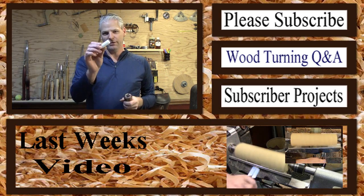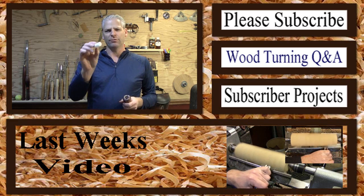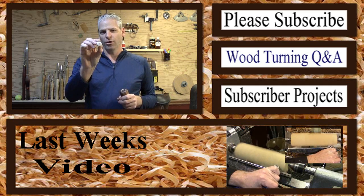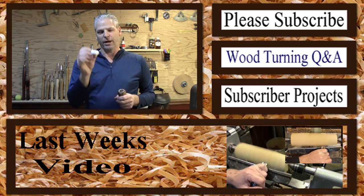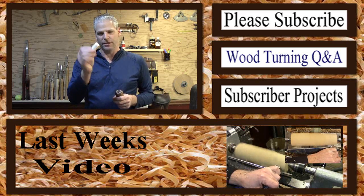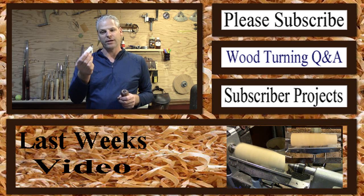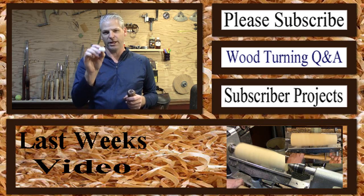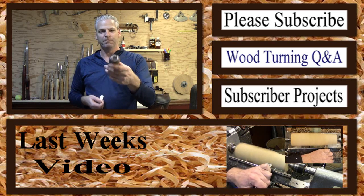Quick note: I didn't show this in the video. I just bought, I think it was a 1-inch bar, that acrylic, and drilled a hole in it, put it on my pin mandrel, and turned it true so that I had the hole centered. Then I just didn't show that little part in there. So I think it's kind of hard if you get the right size acrylic and try and center that hole. I don't know how hard it would be to get that exact. But other than that, it came out great.